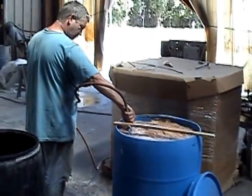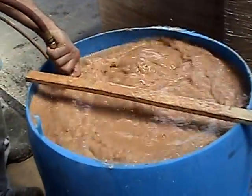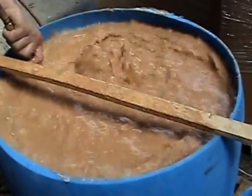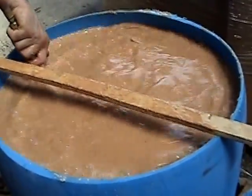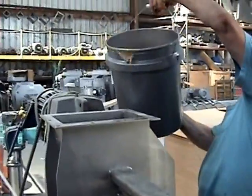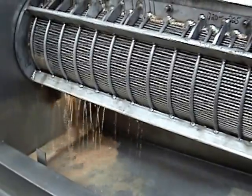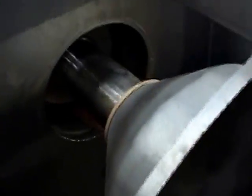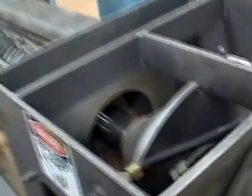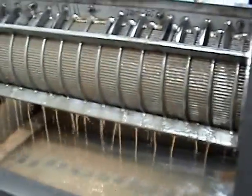I'm back in the test area. I see Bill is agitating our sample. Bill's going to pour some material in, and coming right through that screen — I expect it to blind over. As soon as I see something coming out here, that's sloshing already. I'll close this cone. I've got it set at a fairly low pressure. This cone is now shut, and we're getting a lot of water out.